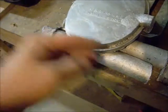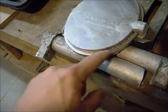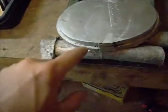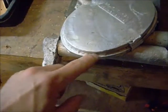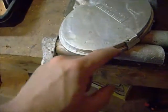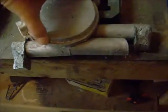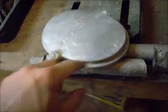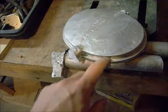It actually comes back out a little bit, just a hair, and I think when I pulled it up, I should have put a draft in there with the body putty as well along this whole edge, because you can see where on the whole edge it's got little bits of sand that were breaking away, causing me to have metal in there. That whole spot is the only space I had that problem, and that's where I didn't put in my body putty. So even on the back, I guess it's important. Although I'd still have a fillet just like this, just a smooth one instead of a rough one.